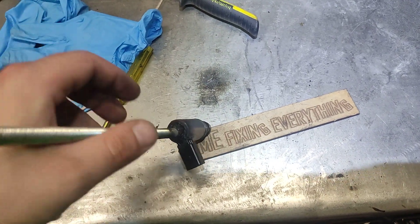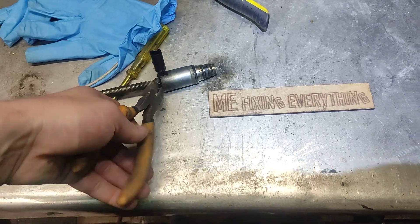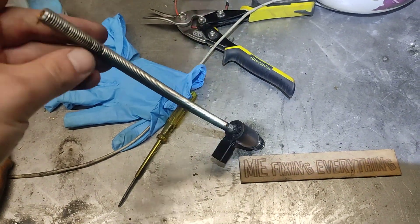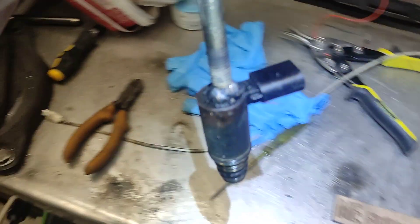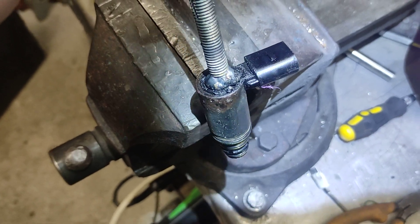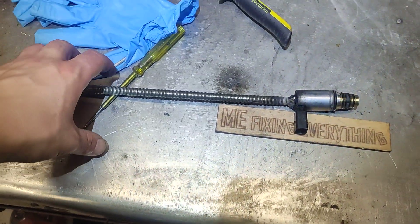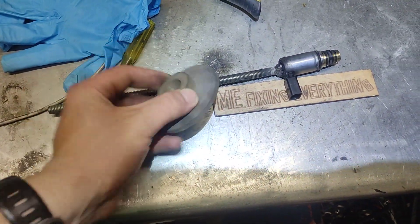What you can do is take the plastic cap — there is a plastic cap on top — you just take a pair of snips and take it out. Then you take a rod, weld the end, you can put the ground on the end of the rod, just weld to the end of the solenoid valve, and then put a washer here, something heavy, and just smack it off.